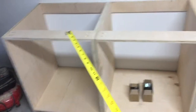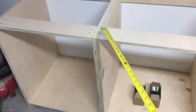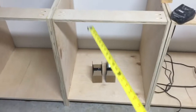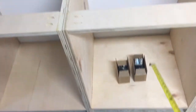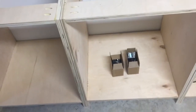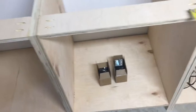You can get six pieces of plywood like that and build two cabinets. Take the two of them — that's 32 inches — and you'll use those as your sides. Now the third piece: after you cut the first one at 32 and the next one at 32, cutting on the other side of the line so it's exactly 32, the last one on that side is actually going to be smaller than 32. So I use that for the bottom and the brackets — the braces — to square up the top. I figure up how wide I want the depth inside because I just did glue and pocket holes on the bottom, and one of these braces uses pocket holes too.